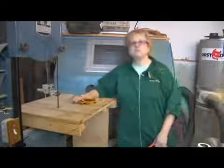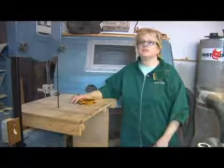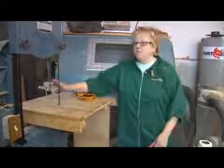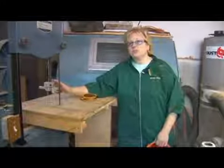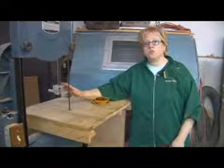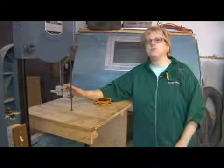In this clip I'm going to talk to you about a couple of the things that you can use in your woodturning to prepare your blanks for turning on the lathe. This is the bandsaw. If you're going to use a bandsaw to prepare your blanks, especially if you're going to be cutting green wood, you want a bandsaw that has a pretty good sized motor.